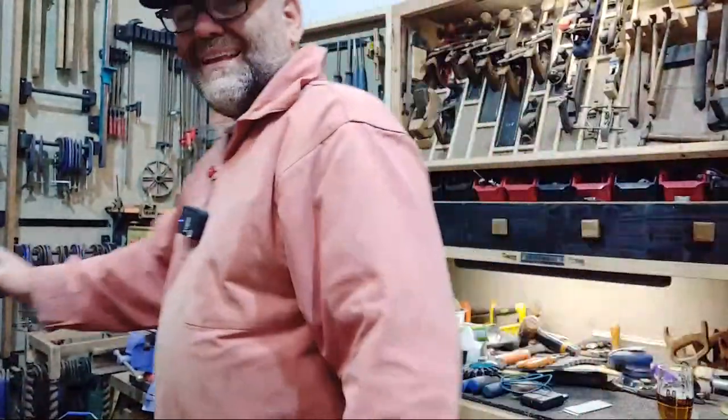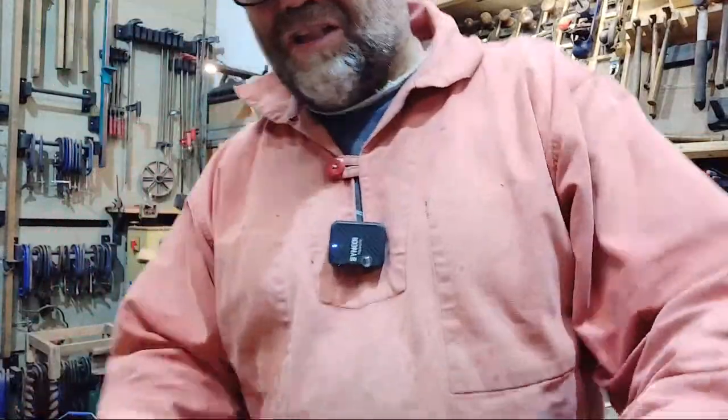So the nails probably poke right through. The screws will be fine. So all I'll do is probably go in there and nip them off with the angle grinder, or I'll just pinch them off with a pair of side cutters, because I only have 18 gauge nails. I'm not going to glue it in this case. It's not a lot of point really. As long as they hold on, that's all that matters.